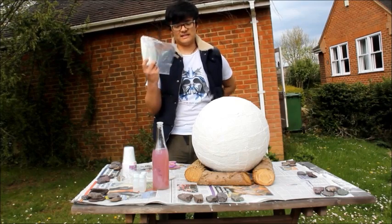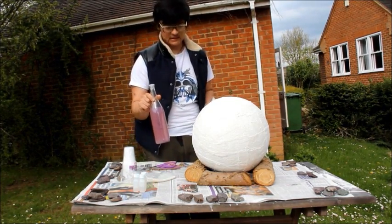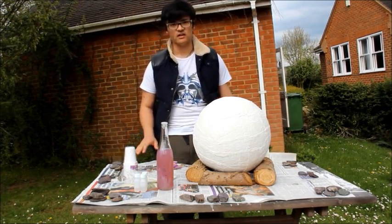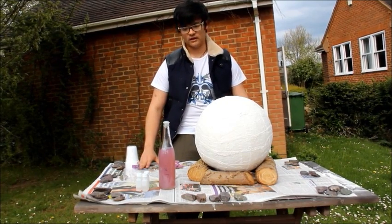We've left this to dry and now we're going to make the hard shell using fiberglass and fiberglass resin, which is a polyester resin. This stuff smells really bad so you're going to want to do it outside. It doesn't just wash off — when it hardens it's plastic — so you want to put newspaper down onto whatever you're working on.